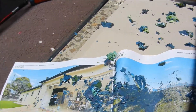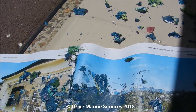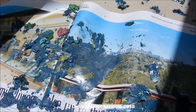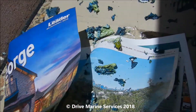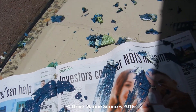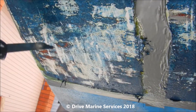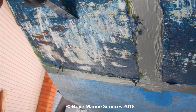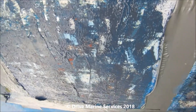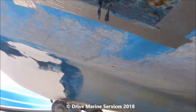The lemon peel is coming off nicely. You can see it's taken off the multiple layers by the colors. It's fairly dry — I normally say cover it with plastic, but we wanted to try all three uncovered in this experiment. Look at the orange peel: it's real wet and gooey and has basically only taken the top layer off. Where we've taken the lemon peel off it's pretty well right back to gel coat where we've had a decent layer. With the orange peel it's basically only taken one layer off — gooey, horrible, and messy.